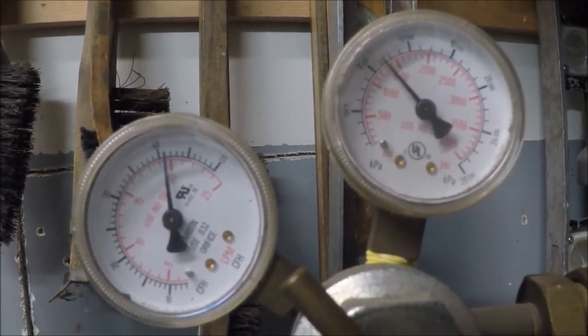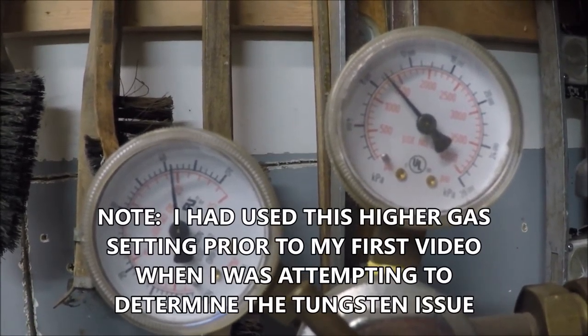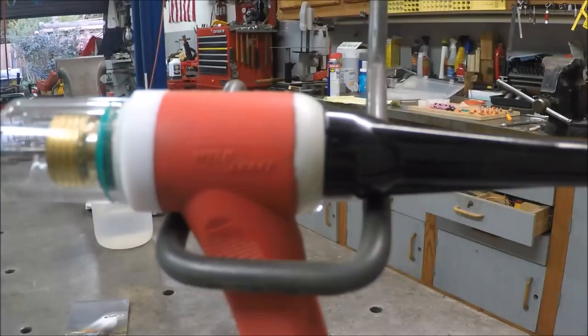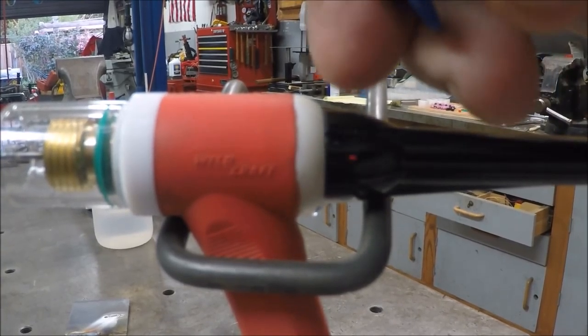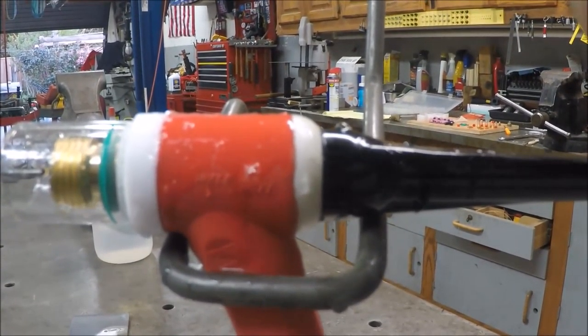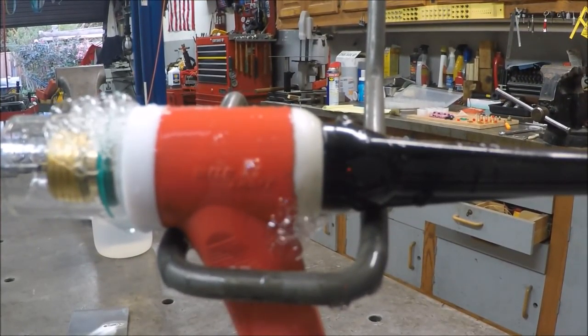One of the issues was: was I getting enough argon? You can see here on my regulator I really cranked it up, so we're getting a lot of argon now. I've got the high frequency shut off. Let's see what we find out here — let's spritz it with some water. And look what we got: I got leaks at the back and the front.